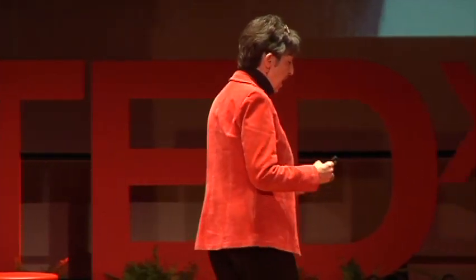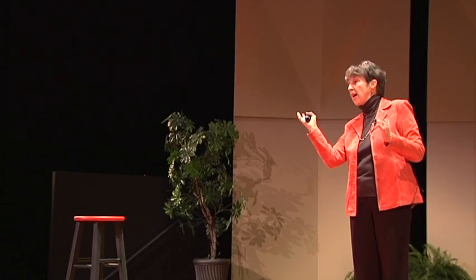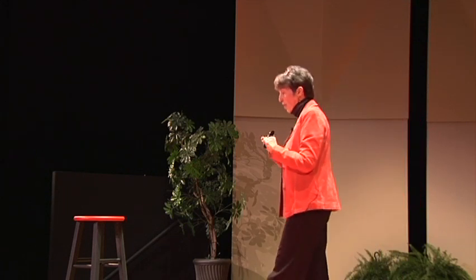How did I incorporate that into my plans? Number one — how do I allow the sun in during the wintertime? Well, I have a lot of windows, and this is my southern exposure. Do you remember being in third grade? You study the solar system and learn that the earth goes around the sun and that our earth wobbles on its axis. That wobble is important for building solar, because in the wintertime that sun is low in the sky, and it comes in the windows and heats up the whole house. Most people have some solar already — if you have windows in your house, you've got solar.